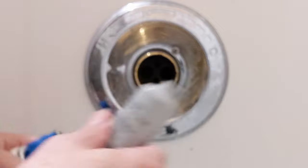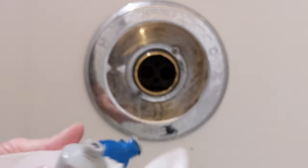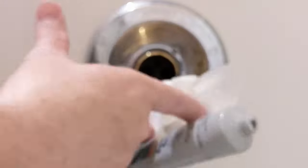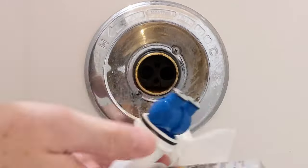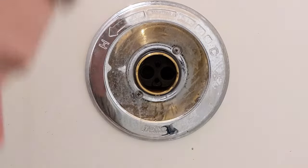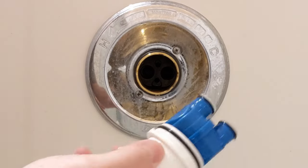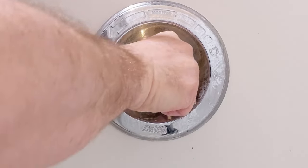To help with the o-rings, I'm going to apply some Super Lube. I use this on o-rings a lot — it helps with rubber in general. Just any kind of plumber's grease will work, but this is a synthetic food-grade grease. It helps with installation and keeps the o-rings from binding or rolling, so they should slide right in.